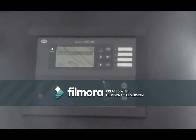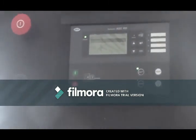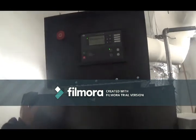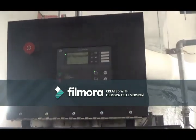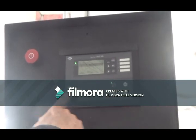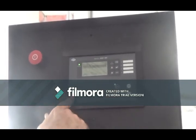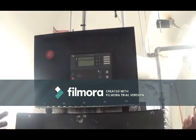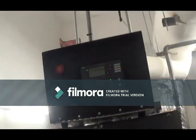Automatic is something you expect all the time, at all times. If the generator is not on automatic, when you get a power failure, the generator will not start. You can put it on manual. Once you put it on manual, then you have control over these ones. You press zero and you disable the generator completely. Then you don't want to be working on the generator.